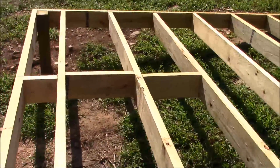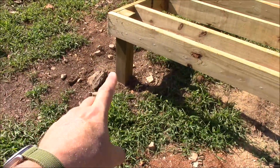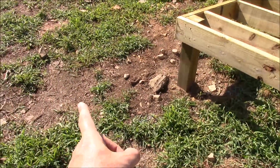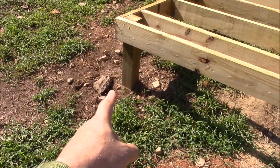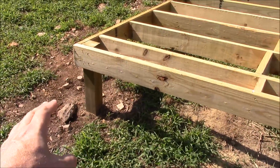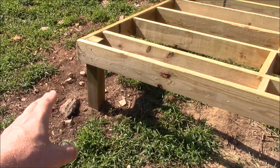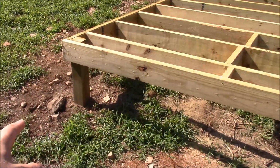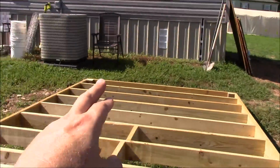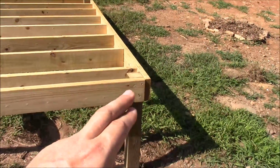And one other thing real quick, in the last segment of the video that I shot, I still had the strings up, and I was showing you that when you have the strings up to run your stake lines out quite a bit past where your corner posts are going to be, and then you can hook your supports up to it. But I didn't really cover how to make sure that the lines that you have are correct. And so what you would do is, if the string lines were still there, you would measure obviously the string from there to there and make sure you have the same measurement as you would from there to there, and then, you know, again the same thing here, there and there would need to be the same.